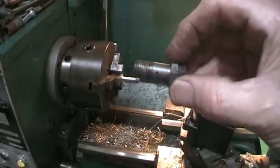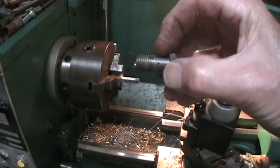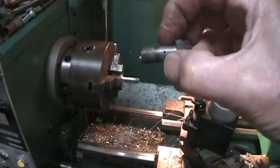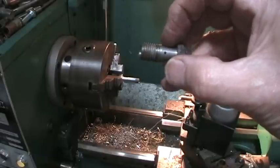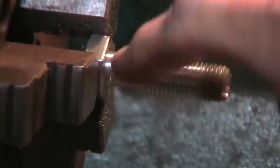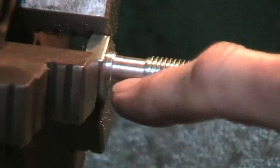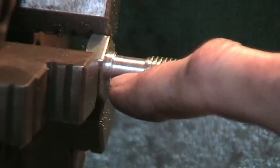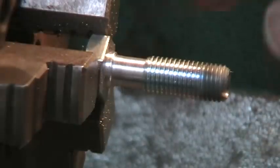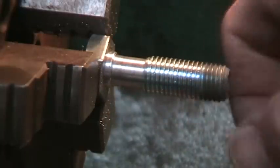Now this is the one that came out of the engine. It's on the injector side, the higher pressure side, and it's got a tiny little hole. Other banjo bolts I've seen have had larger holes. So this one, I think I can get away with drilling three holes around there, or maybe just two — I haven't figured that out yet. As long as their diameter equals a quarter inch, and the space between here and the part that's going to go over it is a quarter inch, I don't think it'll restrict any flow.